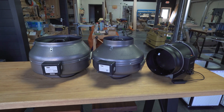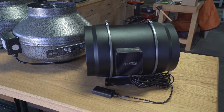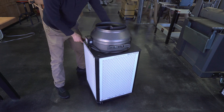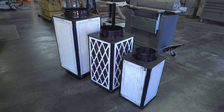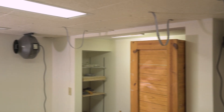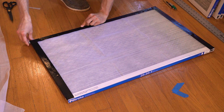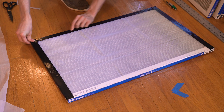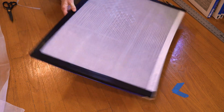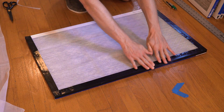To power a ducted system, you need an inline duct fan. They can have no features or all the features, a low price or a high price. You can put them on top of one of my kits, or hook a duct to the filter and mount the fan on the ceiling — that option allows you to run multiple fans at once off the same filter. I highly recommend using 3M MERV 13 or 14 filters; they are the most effective filters I have tested and even outperform budget 2-inch thick filters. No matter what filter you are running, you can duct tape some screen printing material to the surface of the filter so that you can vacuum it, which significantly increases the lifespan of the filters.